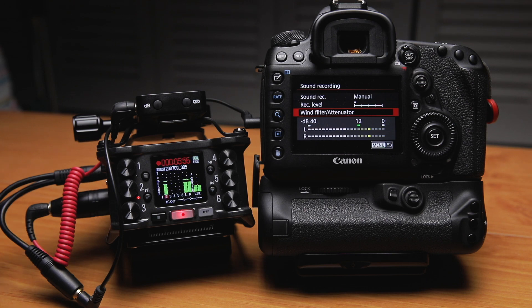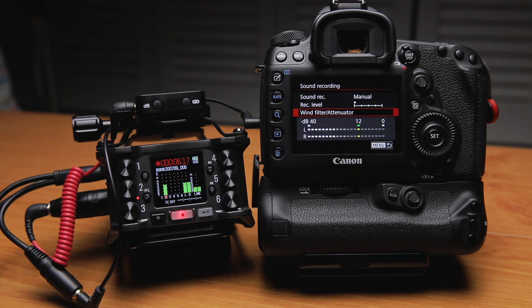That's all you need to do to configure it. In my testing this provides good enough sound quality and enough dynamic range to be a perfectly acceptable backup track if you need it, or it works perfectly well for syncing audio from the recorder to the video files on the camera. A little bit of attenuation on the Zoom and very little gain on the audio input on the camera, and the noise floor is at least minus 40 dBFS on the camera — if not more. If you found this useful, smash that like button and please consider subscribing. Thanks for watching and until next time.